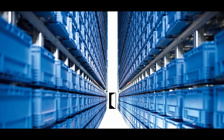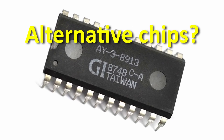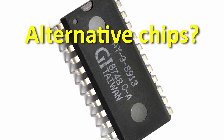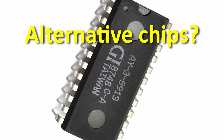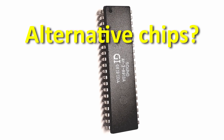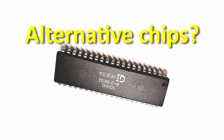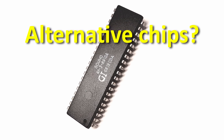I'm still trying to find new sources, for example by asking some of my brokers that I know. The AY38913 chip is somewhat smaller than the AY38912, so some time ago I wanted to find out if a small adapter board would be an idea. But unfortunately almost all of these chips are not working — I've tried several suppliers. There's one more option, the AY8910 version. It's still available and a lot cheaper than the AY38912. However, this chip won't fit on most boards that I need them for, and it turns out that many or most of these chips are actually remarked YM2149 chips.